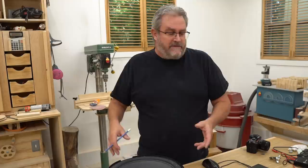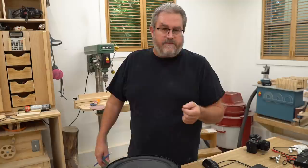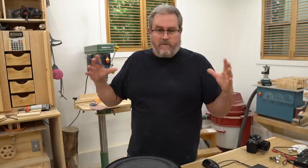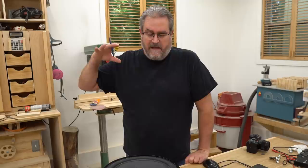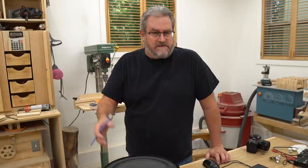I'm going to be using all four woofers in two speakers, two in each box, in an isobaric configuration — where two woofers are placed together in the box, one behind the other. You may have seen the clamshell version where they're face to face with the back of one woofer sticking out, but that's not the look I'm going for. I want something that actually looks like a speaker, so I'll be mounting them in line with each other.